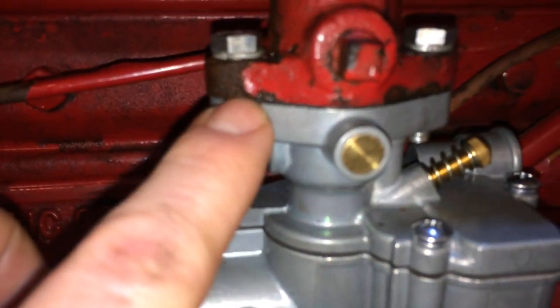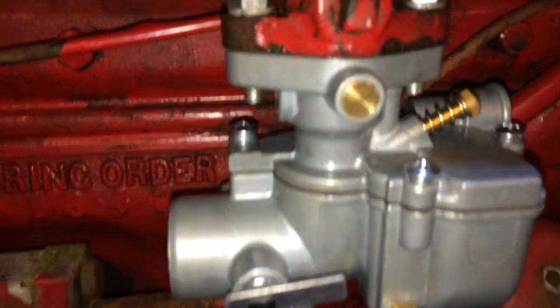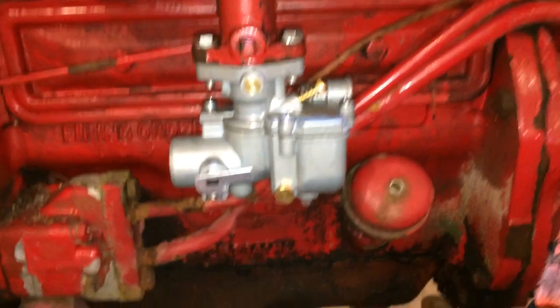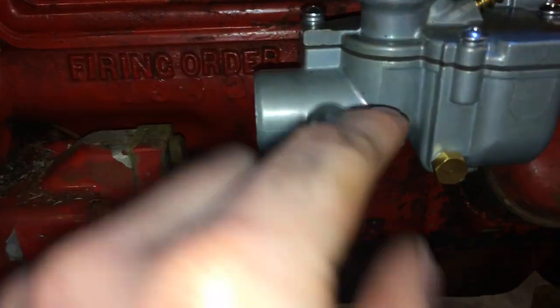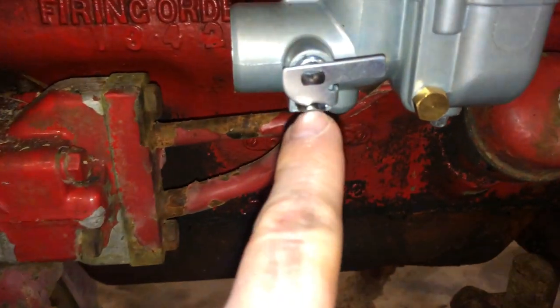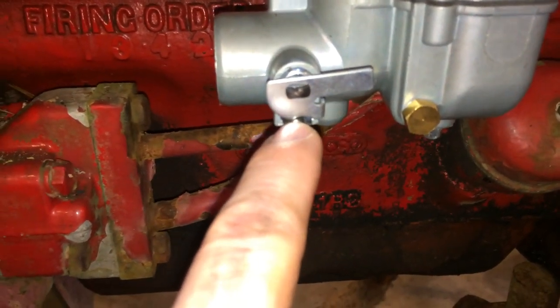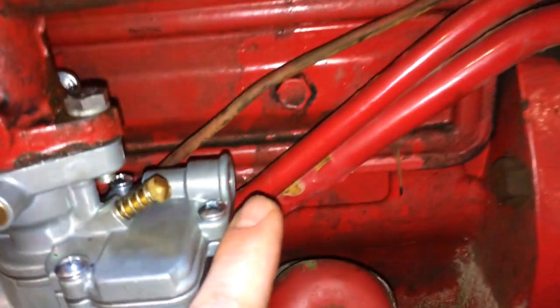Don't forget your gasket — you can hardly see it in there, but it's in there. These are quarter-20 bolts, I think one inch long, and they work great. Put a lock washer on top of them. It wouldn't hurt to put a dab of oil on the choke lever — it's two pieces of metal rubbing on each other. You can also work the choke from the side of the tractor. Next, we're going to attach the fuel line, which goes from here up to the sediment bowl.